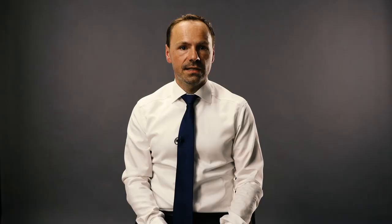High dynamic turning of the CNC Pilot 640 also offers other advantages. Very quick exchanging of the indexable inserts shortens machining times and tool exchange times even further. The special geometries of these tools permit large tilting ranges of the rotary axes, with only small compensating movements being needed in the linear axes. This results in many possible applications with short movements during machining.